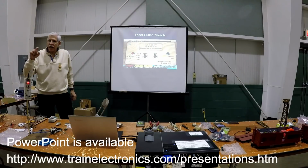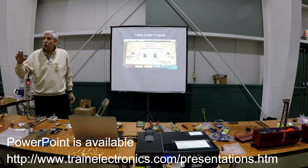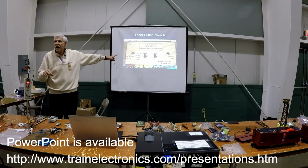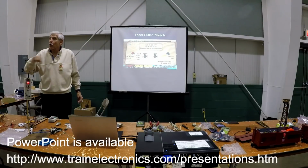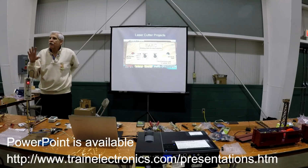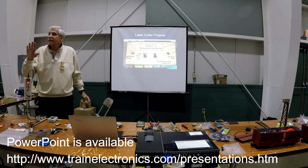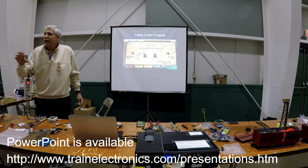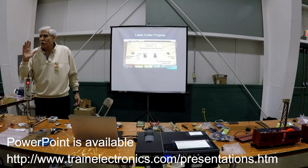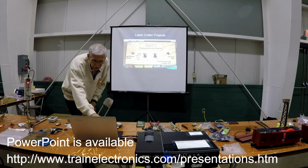The first thing I did is I went into Corel Draw and I said, take all the stuff that's lettered, the words, cut them at a power of 20%, because you're only etching it. Then I had to go back and re-index everything and say, now I want you to go to 100% power and cut out the holes in the outer edge. So it was a pain to do that. The new one will allow me to do things in different colors. Like I would do all the lettering in, say, yellow. And I would say, anything that's yellow, cut at 20%. Anything that's black, cut at 100. So it'll do it with one. Does that make sense? Yeah. And that's a dramatic difference in utility. That's the biggie. Okay. Let me continue.